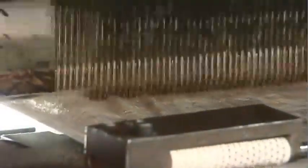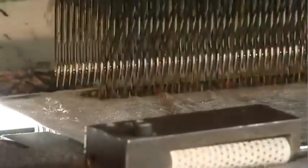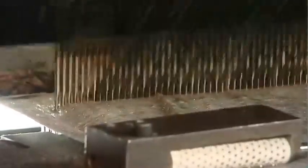Twelfth gauge full repeat. There are several versions of 12th gauge full repeat tufting machines. These machines control the feed of each yarn independently, allowing for pile height and texture variations to create patterns with a three-dimensional appearance. The full repeat machines can tuft both organic and geometric designs. The full repeat allows for pattern width up to 144 inches, or full width.